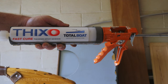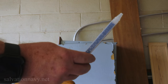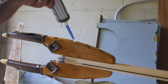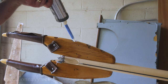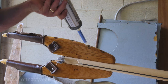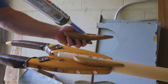To fill, seal, and waterproof the holes and all the hardware in them, I'm using another Total Boat product called Thixo — their fast-cure version. It's a pre-thickened epoxy you can use in a caulk gun; it mixes as it goes through the special tips. A nice feature is that if you don't use the entire tube, just swap the tip and you're good to go — no need to use it all at once. Another thing I like is it stays where you put it: it doesn't run or drip, so it's excellent for non-horizontal surfaces. I apply it to fill the hole, drop in a copper cap, apply a little more around the edge to seal it, and clean up any excess with a rag and some acetone. I also apply a little to the bottom of the spacer to help waterproof and seal the area between the gaff jaw and the spacer block.